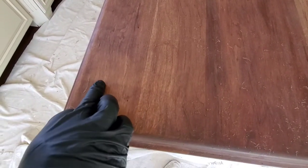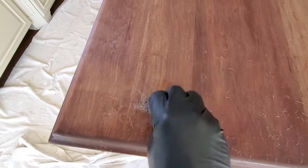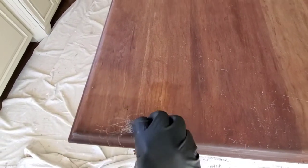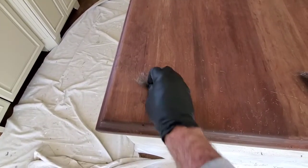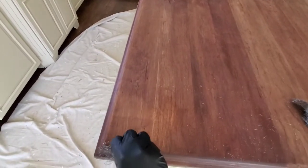You can see this line here, and you can see that line. These are kind of like transition marks. This is a mark that shows you where you've been scrubbing, and you kind of stop right there with your pad. And it's that easy to leave that. Don't leave those. Chances are it would sand out when you get the sander involved, but I don't like leaving those because I don't like surprises when it comes to this. So I'm gonna go back over this, and I'm not nearly done. I just started with this, but